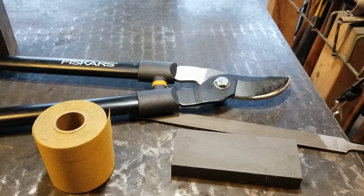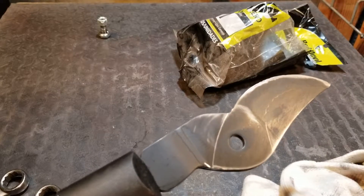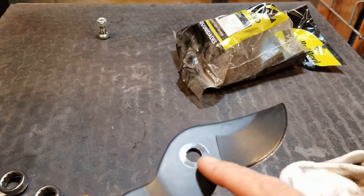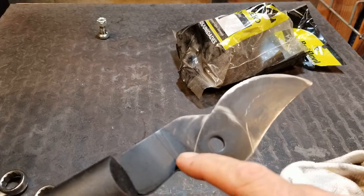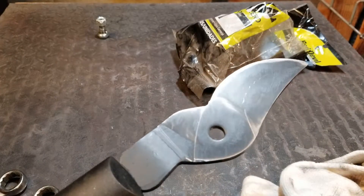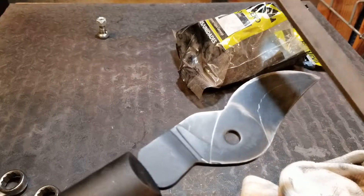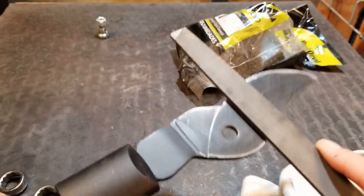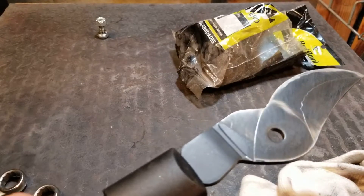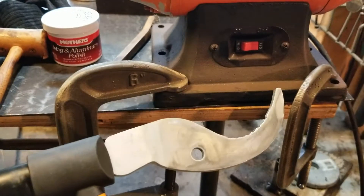The first thing I did was take some mineral spirits and a little bit of steel wool and clean all the pitch off. That sticky tree pitch — you can see a scribe line where the other half of these shears sit and you can see the worn spots. Those are your high spots all through here. I'm going to begin with just a fine flat file and start lapping this by hand to remove the high spots and bring it down to as close to a single plane as I can get it.